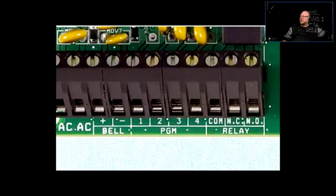And the individual program terminals can be programmed, each individual, to have a specific function. How do they work? Are they just relay contacts, or do they have 12 volts on them? Well, it depends on the system, so you just have to read the documentation on that particular model or brand, or call technical support and ask. In this case, this would be 12 volts appearing on these.